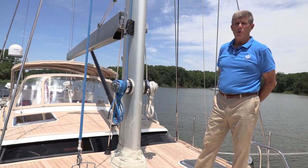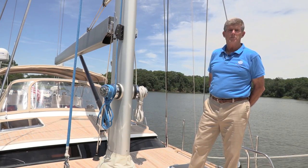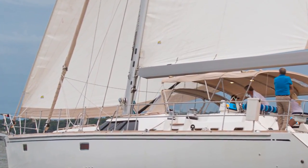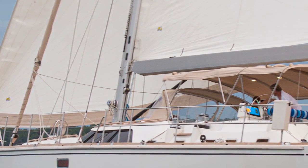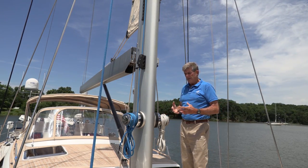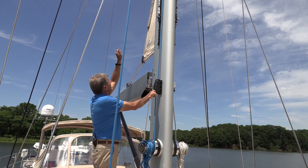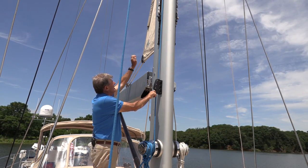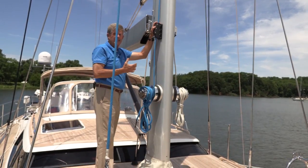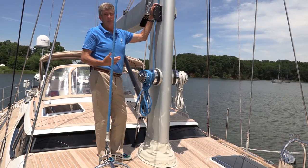That's really important especially because you have two people cruising the boat, and taking sails off a 70-foot boat is a pain. Because they have the halyard locks you don't have the tails, and when you put the sails back up you know it goes to hole number six — it's very repeatable, dead simple for people who don't sail a lot. Once it's locked in it is set, so unlike with a clutch it's never not quite repeating what you think you're going to do.